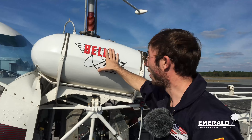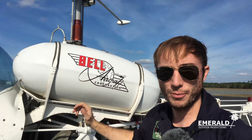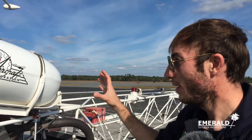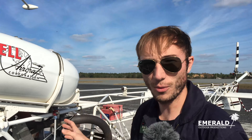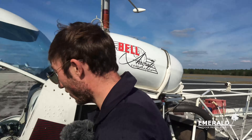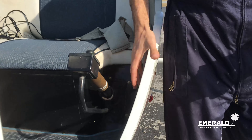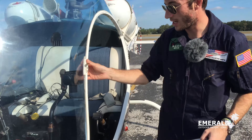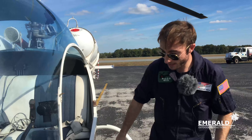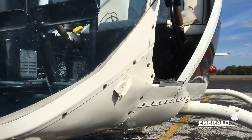The last one is the landing light, which is working too. Now we turn off the landing light, turn off the nav lights. I always like to leave the beacon on because that lets you know if you have the battery on or not. When you turn off the battery, verify the beacon is actually off, otherwise you have grounding issues.